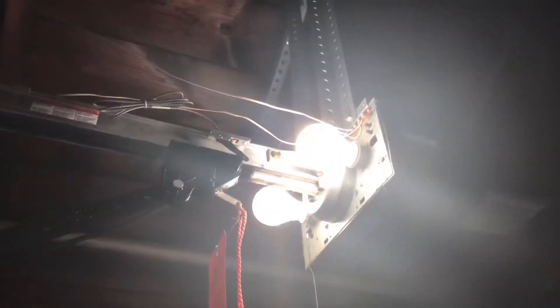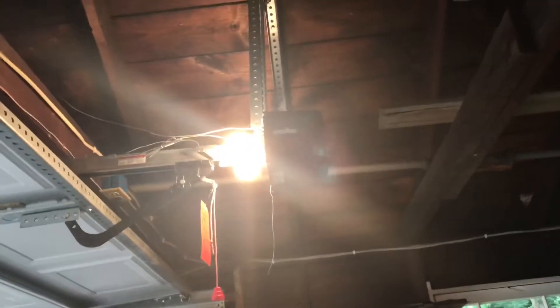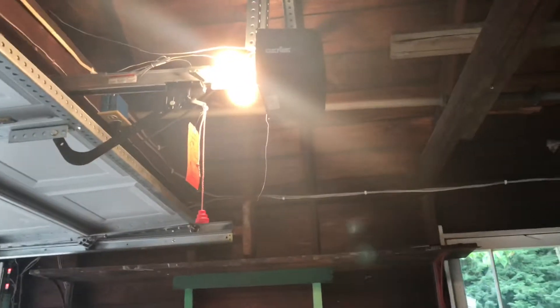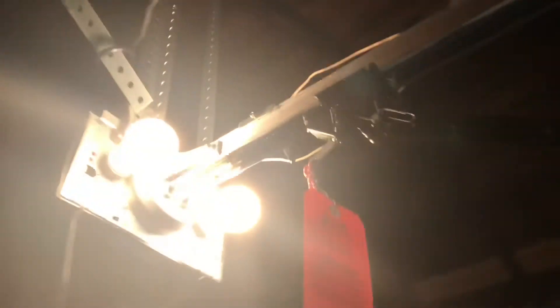If you try to operate your garage door opener and it does require safety sensors but you don't have them hooked up, the motor's not gonna work — the door will open but not close. On some machines it doesn't even open or close with no safety sensors. But on this one the door will open but won't close, because the motor has no reaction to the safety features when it's opening.